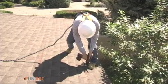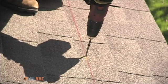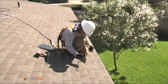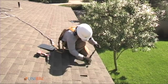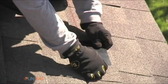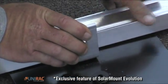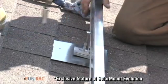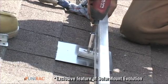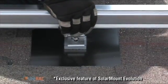Roof trusses are usually made of timber an inch and a half thick. The contractor wants to make every effort to center that pilot hole in the rafter. Next, the contractor is going to free up the shingle above the hole. He may have to extract some of the shingle nails that are in the way. He'll then insert the flashing, centering its hole over the one just drilled in the roof. Now the contractor can start fastening the beam and flange connectors together and fasten that sub-assembly to the roof. With this particular flashing system, a single lag bolt is used right through the flange connector and flashing and into the roof.